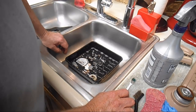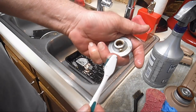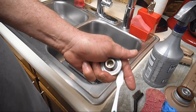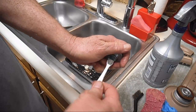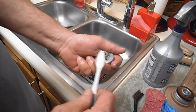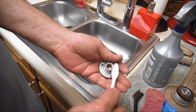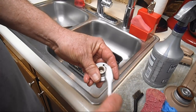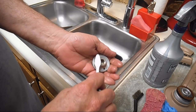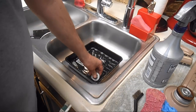Now, let's take a look at the back of that hand wheel, because that's where that clamp washer is back there. And somebody had put grease in here and on the shaft. And I usually just put a little oil, because you screw it on, once you put it on, you screw it on. So I put a little oil with that PTFE, so the next time I want to take it off, it's not varnished and stuck on there. But I don't know, maybe they used to put grease at the factory. I don't know. That's looking good.